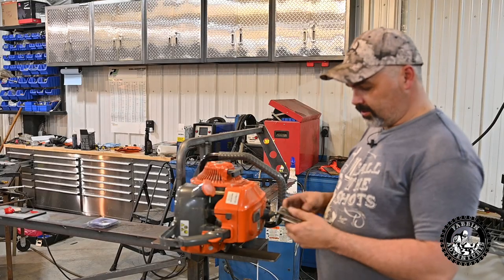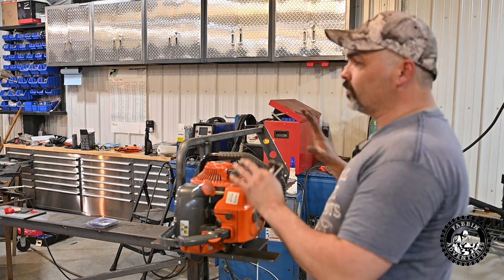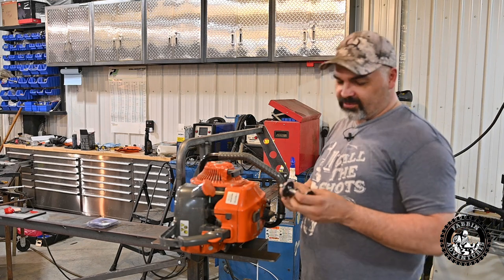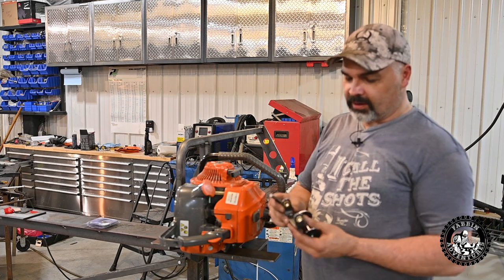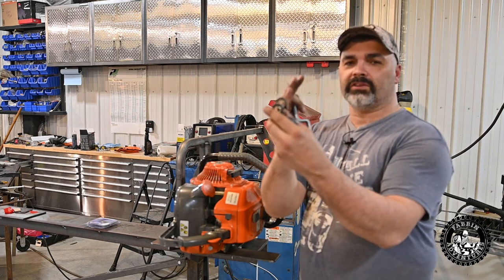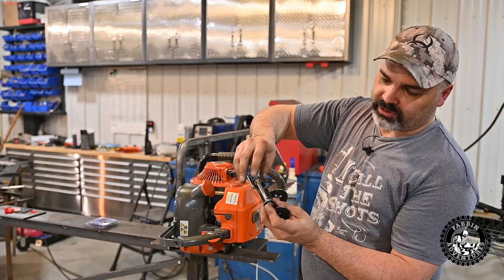We got the crank here just about done. It's gonna get mounted under here, and when you're cutting along, you're cranking this and it's what pulls the whole carriage along. It's way more precision than it needs to be, but it was kind of fun seeing if I could make it precision like that. The tricky part, or not really tricky, you just had to be careful, was to get these ears perfectly dead on aligned, not out, because if they're outside your pin would never line up with these bushings that I made.